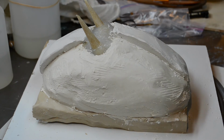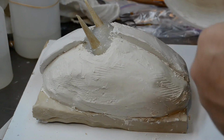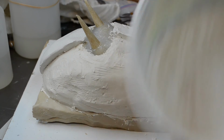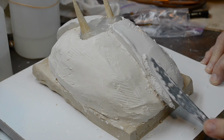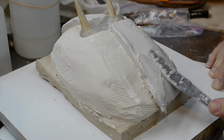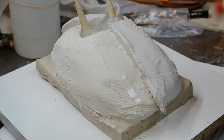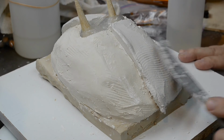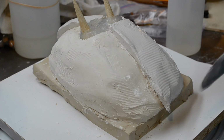Just keep turning it and working the plaster onto itself. When you get it out of the container, you can create a little strip of it with the knife, a little strip that you need. And when you've got that made and it's on the knife, simply put it into place like so. Blend it in. Now I do have my squirt bottle here today. So, a little squirt of water just kind of activates the plaster again. Re-energizes it.